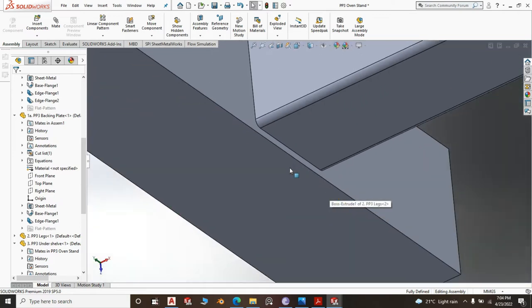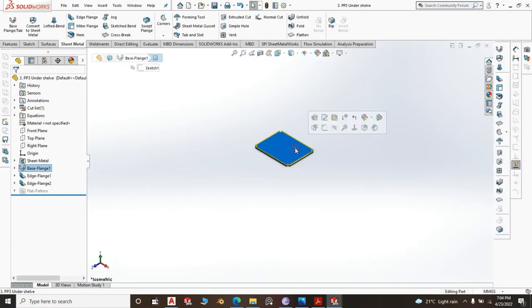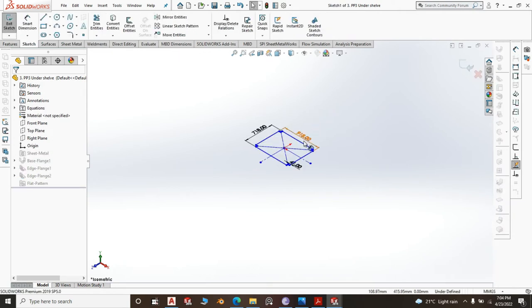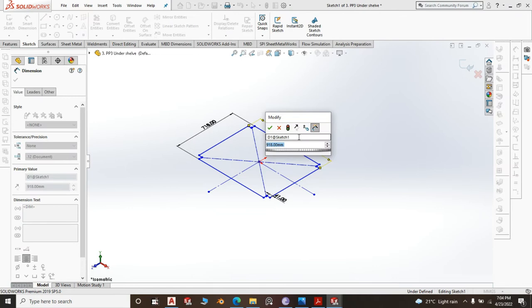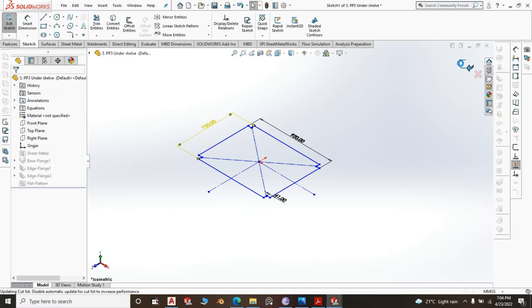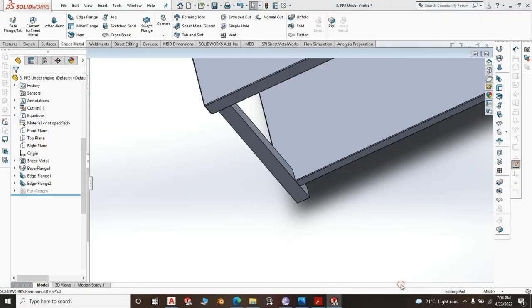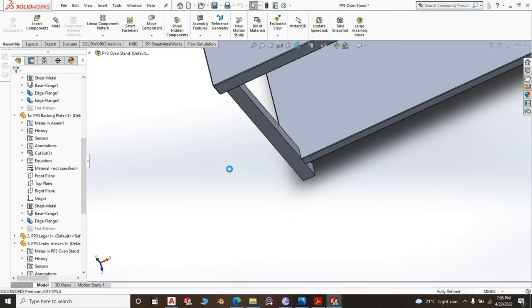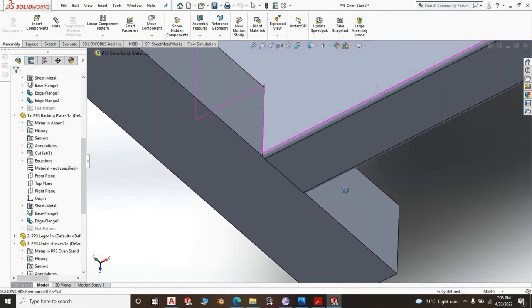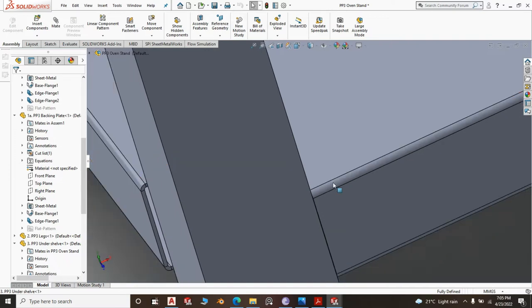And as you can see, the 719, we edit this and do it at 720. The base flange, we edit the base flange and make it 920. That 2 millimeter is not doing us justice by 720. Keep telling you, if this was AutoCAD, then I don't know. The beauty of Solidworks, you can edit the initial sketch and the thing adjusts itself. Yes, now you see it is fitting pretty well. And the gap, do we have a big gap? We hardly have a gap.